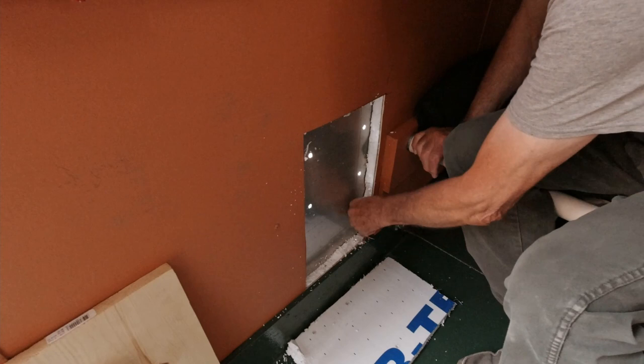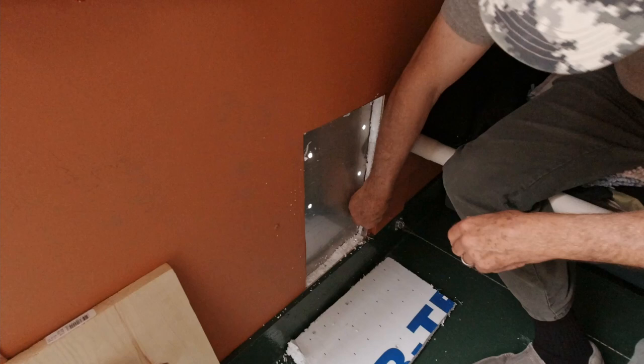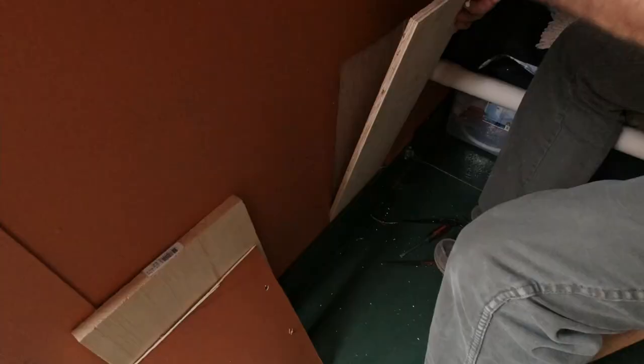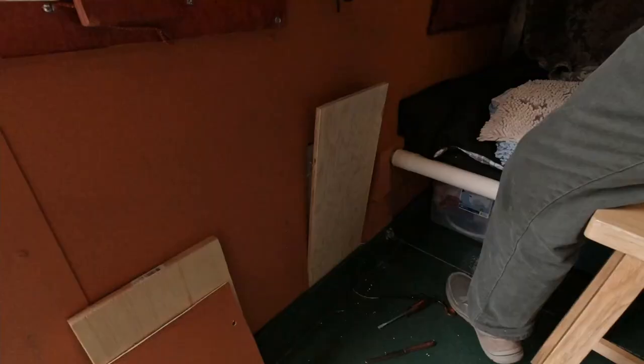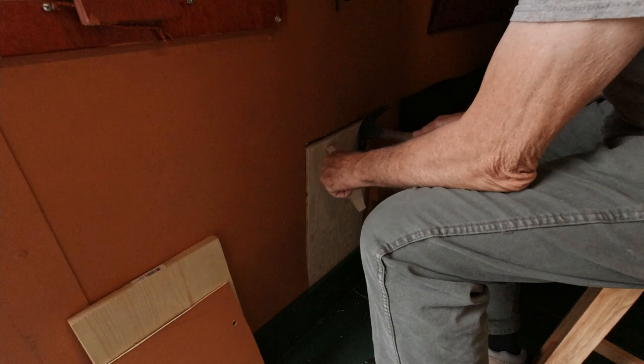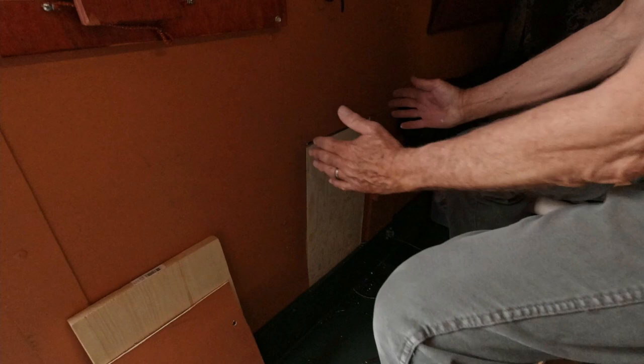The holes turned out right where they're supposed to be — I just looked on the inside. I put construction adhesive on the back of this piece of plywood; I already got a half-inch piece of plywood in here. Now I'm going to try to fit this one down inside and fill up this space — hopefully it fits. We've got a big thunderstorm passing by. Now I need a bigger piece of plywood on the outside here that takes the load down to the baseboard. I'll go cut that piece of plywood, and basically this will make one solid piece inside the wall here.